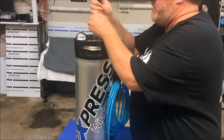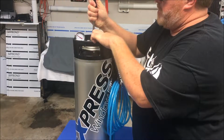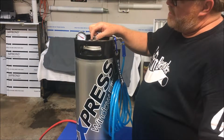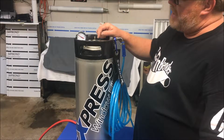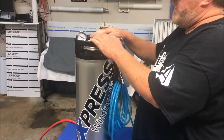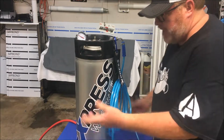We have this thing set so when it reaches 90 PSI, the pop-off valve, where we change the spring and regulate it, releases the pressure down until it gets back to 80 PSI. And when it reaches 80 PSI, what you have is exactly enough pressure on 4 gallons of water to deplete the whole amount of water or solution in the tank.